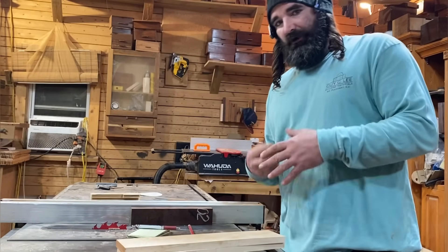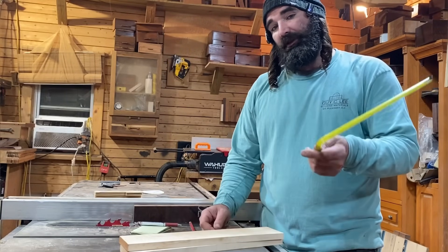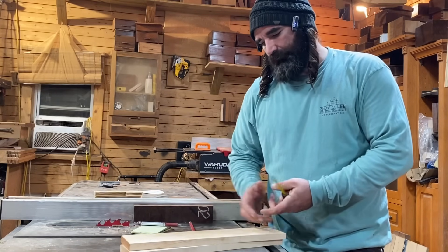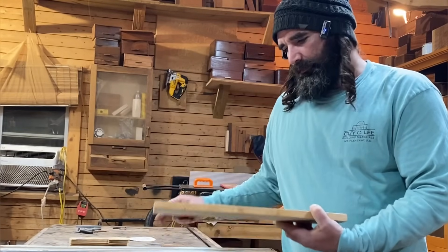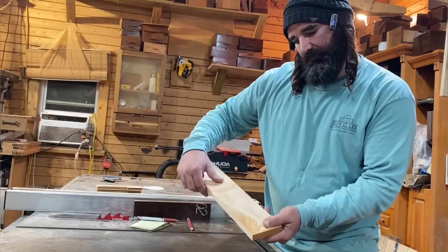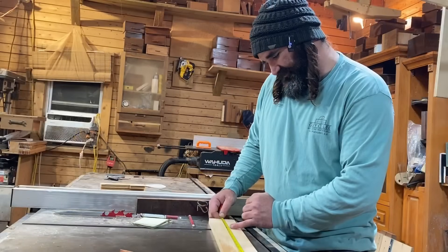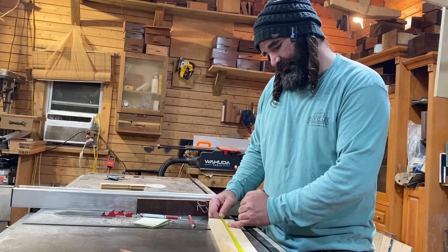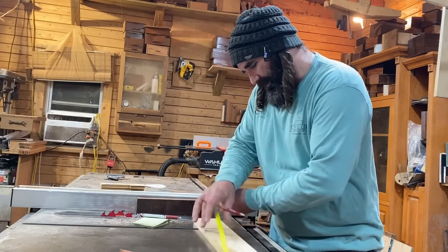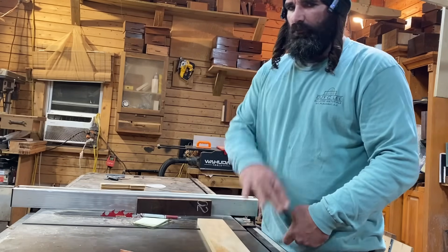I couldn't find the dimensions of their magnetic key holder slash shelf, so we're gonna make our own dimensions. These are 17 and a half inches long, so I only need one. I really like this dark area right here, so I'm gonna implement this into the actual shelf part. I'm gonna cut it square to long, 13 inches across the top, and then across the side for the side piece, I'm going to cut it square to long, 4 inches. That might wind up changing, but we're gonna start with that.